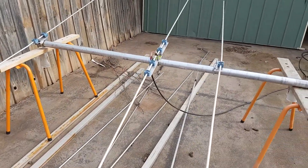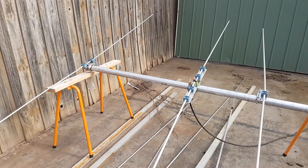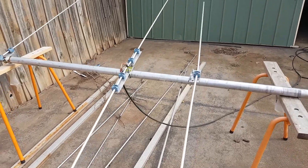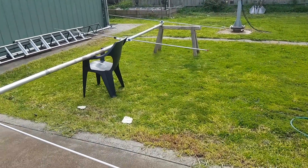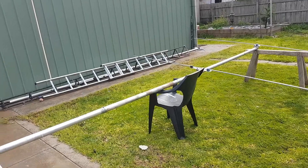Quite good. This antenna at the moment is currently resonant at 50.512. Surprisingly, I was only 5 and 4 to him and he was only 5 and 5 to me. And at 52.100, it was about 5 and 5, 5 and 7. So it wasn't too bad at 52 MHz. So where the SWR meter was, wasn't actually the best location.